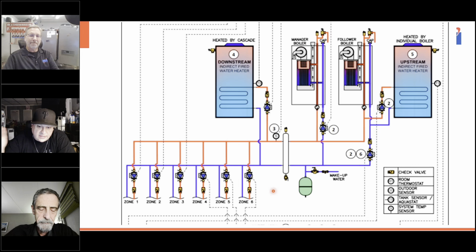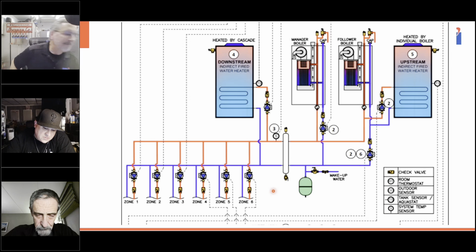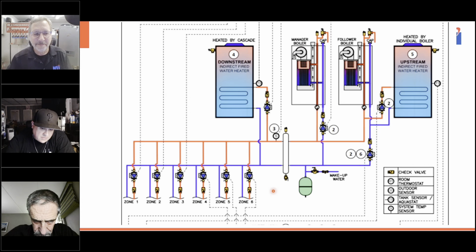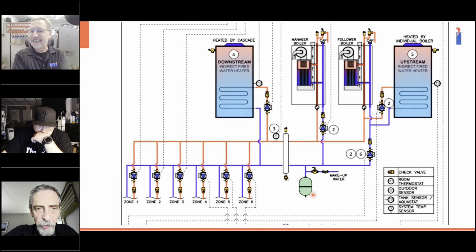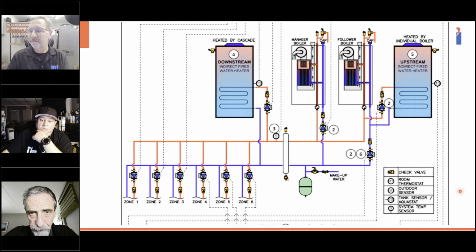When you give it a priority setting, that's going to take that level. I see what Uncle Steve did here. He showed the six zones and he showed his external control. Makes sense to me. But like you said, you can do additional zones, just break off these separate zones into other little zones. Every one of these has its own unique characteristics, theoretically. Exactly. Its own zone. As you were grouping what happens downstream of this with the same sort of characteristics, any one of these could have multiple zones coming off.